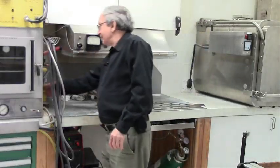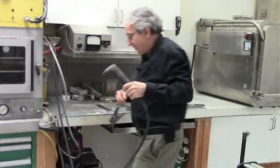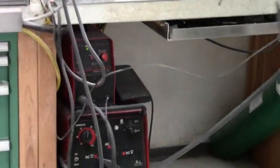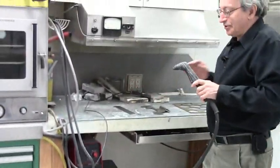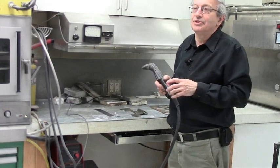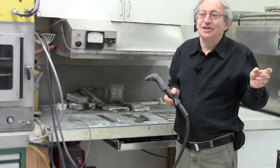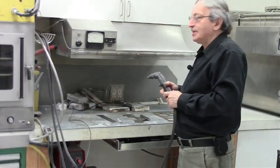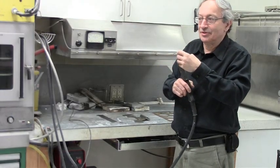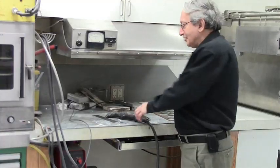Now a quick demo of something very inexpensive and useful — an air plasma cutter. This is a top unit; it's very light. All it needs is compressed air and regular household power. If you have a water jet cutter, most of the time you never use it, but you still need it sometimes — for example, to cut a hole in a box or enclosure which is too big to fit into the water jet. If you're working on a car or a cabinet you can't drag into the water jet, but you still need to cut a well-defined hole, you cut a template on the water jet — allowing for the oversize of the nozzle diameter — clamp it to the cabinet, and use it to guide the plasma cutter.